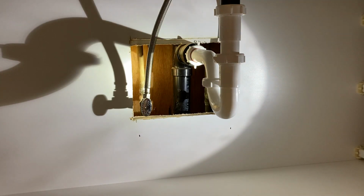So here I had an extra shark bite shutoff valve because I had bought one for the toilet, forgetting that when the guys were here helping me get the shower installed, I had asked them to run new pipe through the wall and come out so I could add a shutoff to it at the wall of the toilet, because the only shutoff for the toilet was down in the basement and it had a flex hose coming up through the floor and wall. And if there's a problem with the toilet and you notice it, you don't want to then run downstairs and hunt for a shutoff valve.